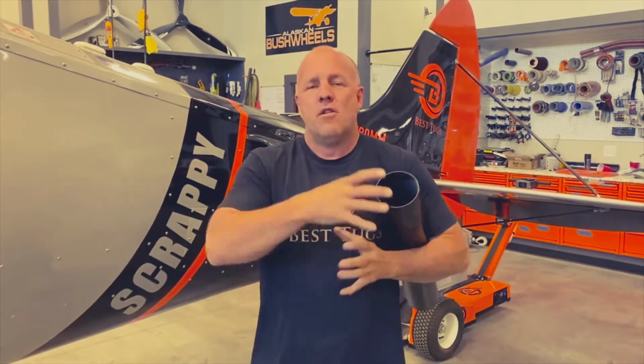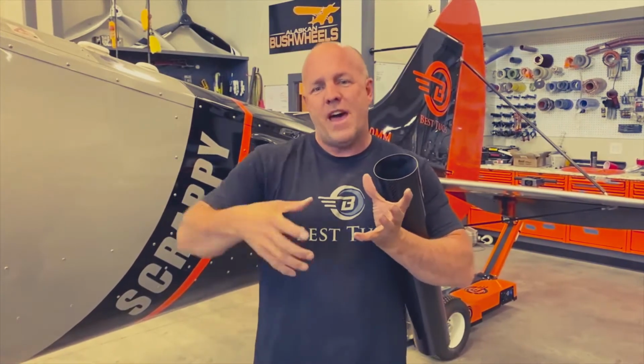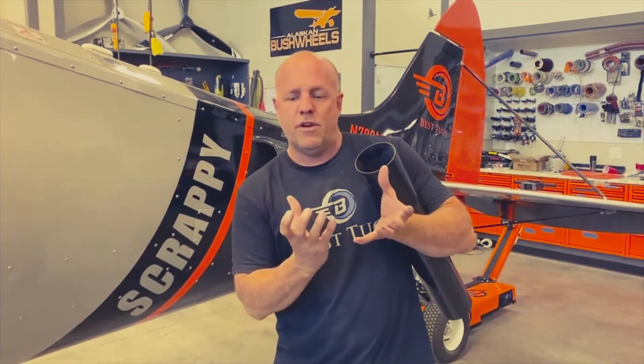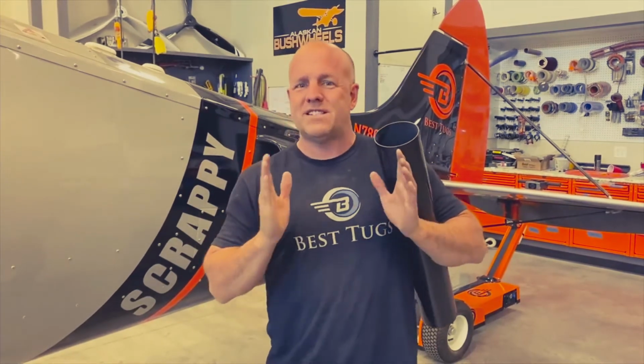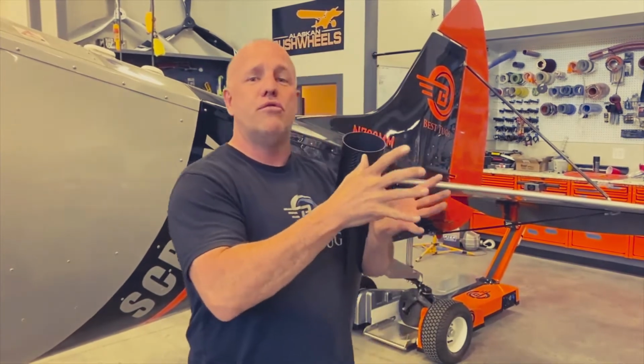This is so that where the air comes through the filter, right now I've got it just piped into the engine to do some airflow testing and ground checks, but that bend is coming out and there'll be a sweet carbon bend with a bypass secondary carbon tube, this one, that will go to a spring-loaded door. That spring will be sized so that at full power under all conditions, it stays shut and all the air is coming through the filter.